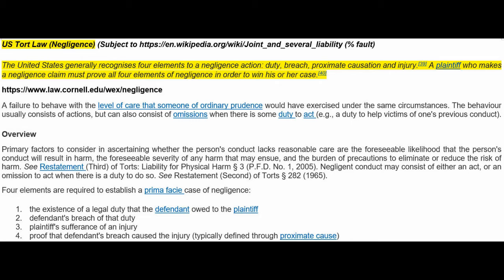So that's the question here, right? So let's say the person being sued were a manufacturer, making duct fireproofing or fire resistive ducts, and tested this to ISO 6944 or ASTM E2816. Is it reasonable that these folks would know that the pressurization fan is located inside that ductwork?